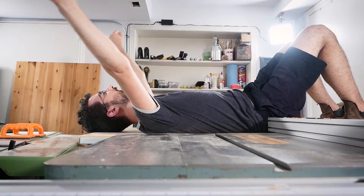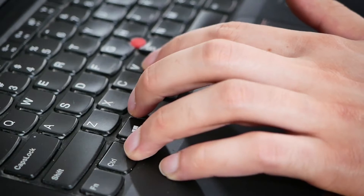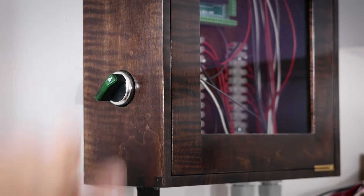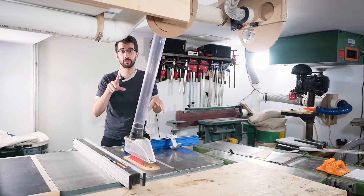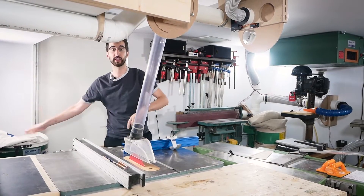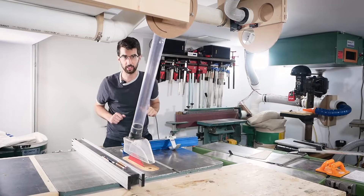I'm finally done. I finished wiring all the machines. I changed the code to reflect all the machines in the shop, not just the single prototype I was working on. Now I can just test it out and hope that it works — I will be destroyed if it doesn't. I'm going to test it with the table saw. The table saw has two dust connections: one for the overhead using this blast gate, and one that goes underneath. There's a blast gate down there which you can't see, but I'll let you know if it works.